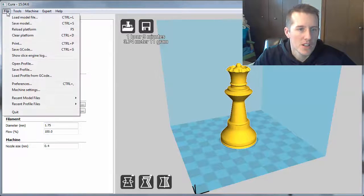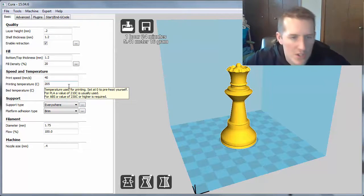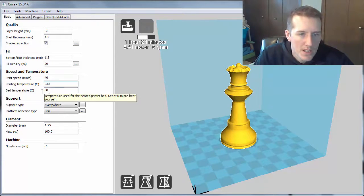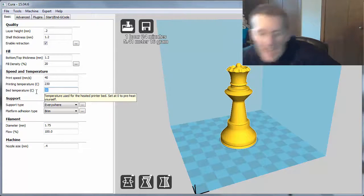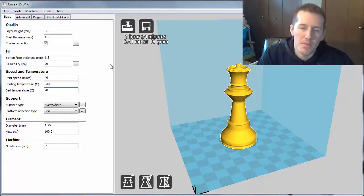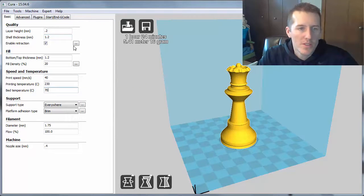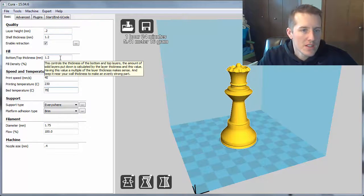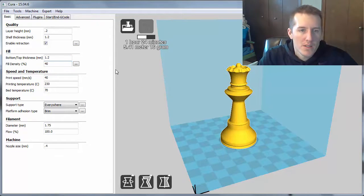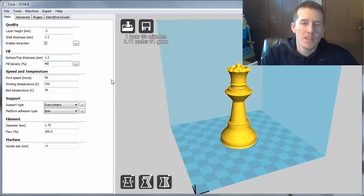The first thing I usually do is open up a profile and bring in a PLA, but you have to change the temperature first. They recommend 220 to 240, so a good starting point is 230. Bed temperature they recommend is 80 to 50 degrees Celsius — I'll start at 70. From there you'll be changing things based on the part. If you want it very detailed, you can lower the layer height; 0.2 is fine. Shell thickness and top/bottom thickness are fine for this part. I might set infill to 40% to make it a little stronger. Print speed will be fine, but I can slow it down for more detailed parts.